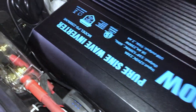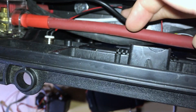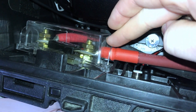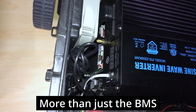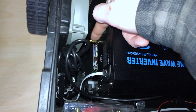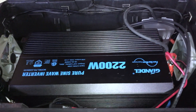Taking a peek on the inside, we've got the display down here. The power switch is actually wired into the display, and then it runs back over to the BMS. I did add an ANL fuse so that I had some kind of overcurrent protection off of the battery. And then the coulomb meter was removed from down in there, directly beneath this ground pin if you can see it. That bundle of cables right there is coming from the display.